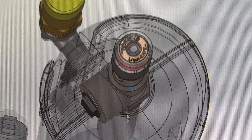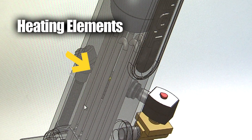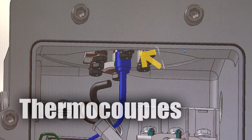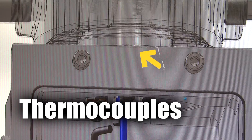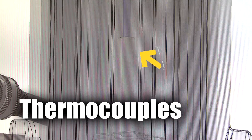From the cold off condition to ready for operation requires only a few seconds. No competitor can match this performance. Our heating elements are cast in place within the aluminum core. Two thermocouples, both housed in a common sheath, directly control normal operations and also provide over-temperature protection.